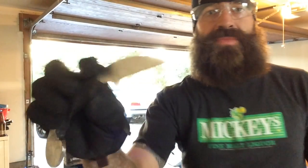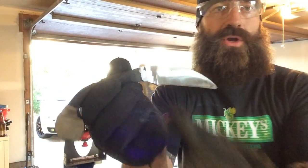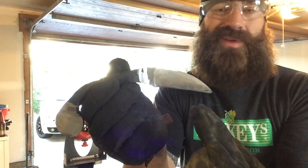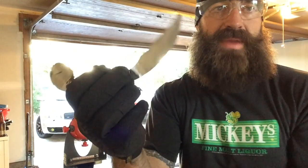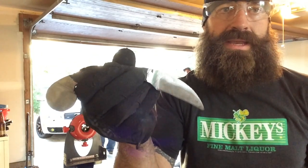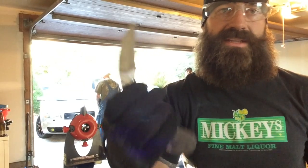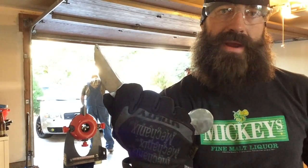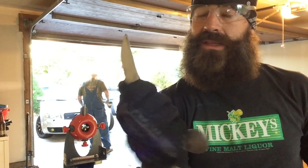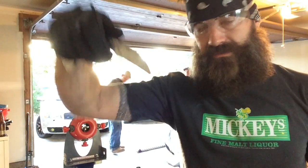All right, I'm through the meat of it. I've rounded off and evened out all of the ring hole, and I've also straightened the whole blade. Well, not polished, I've just straightened it out. I've made it level on both sides, gotten rid of all the flat spots on either side of the blade. So now I'm gonna harden it, and then I'll get ready to get the edge on it on the other side, so this is gonna be a nice and sharp karambit. And you already know what that looks like, so I don't think I'll make you deal with another hardening video, but that's where we're at right now.